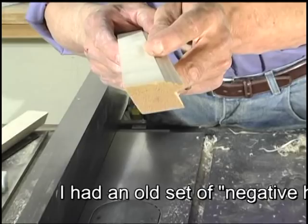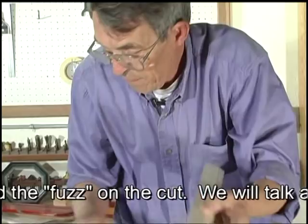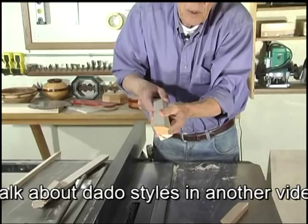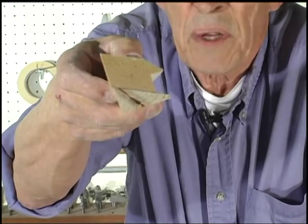And I don't know why that basswood fuzzes up like it does, but right there you'll notice how now the surface the picture sets against, the top of the rabbet, is now square to the edge of the material. And what that means is when we set that molding on top of that wedge, everything's elevated to the angle it'll be at when the frame's assembled. And by doing this and going from one side to the other, we don't have to do any of the garbage most woodworkers do when they do compounds.